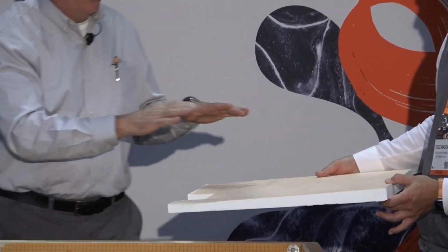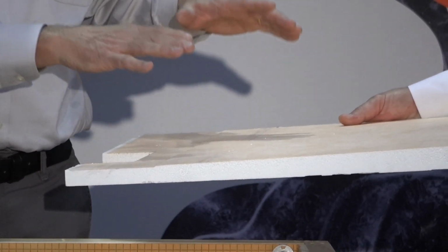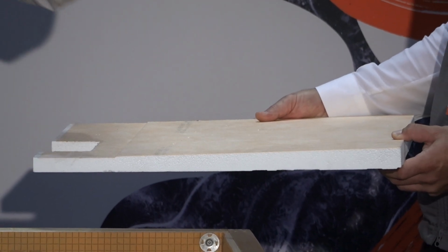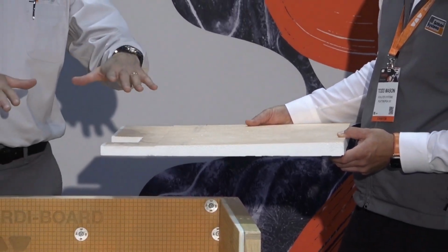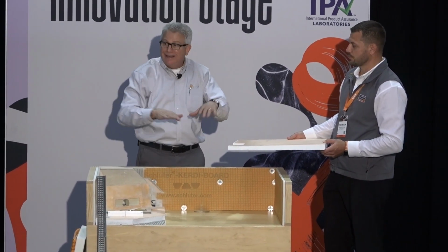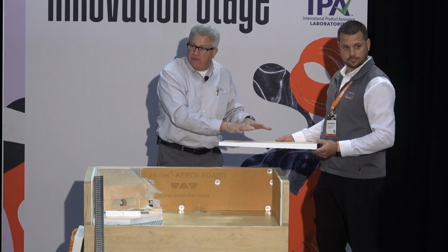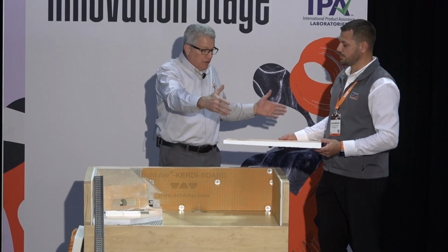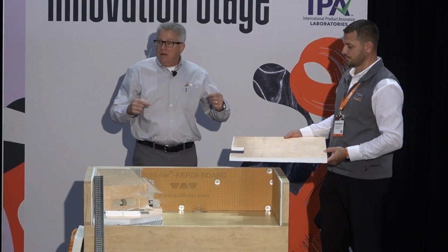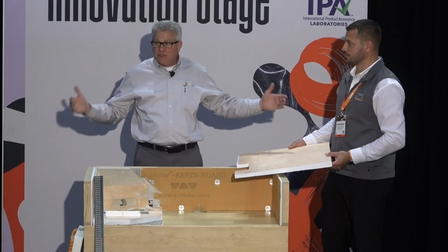What that allows you to do is use any size tile you want on these trays. That's really the benefit to the consumer and the designer, who don't want to change from the large format tile they're putting on the main bathroom floor to a smaller format tile in the shower. If you have a point drain sloping in from all directions, then of course you're limited by the size of tile you can put on that shape. That's where the benefit is. You're not limited to any size; this could be one big tile. That was really the benefit of the line drains. Our drains that are out there come in 4-inch increments from 20 inches clear up to 72 inches.